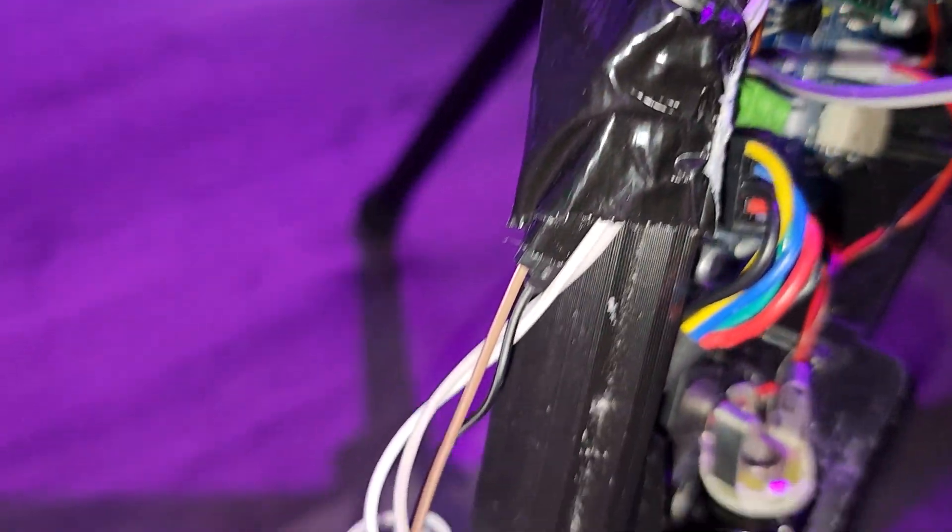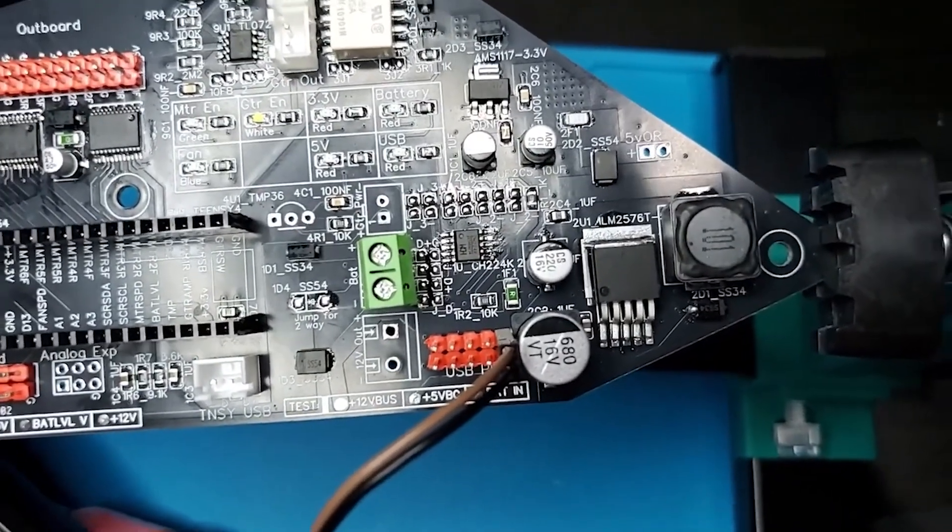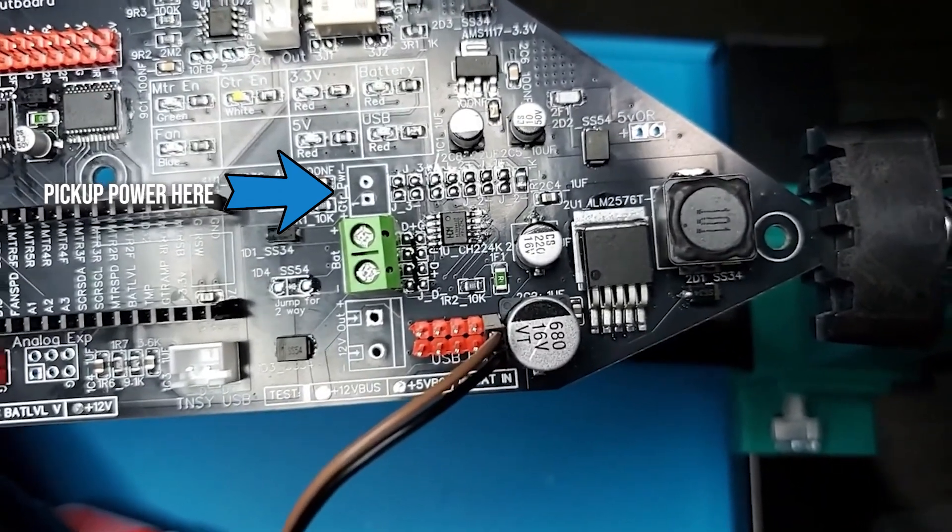I will say that it's still there and there is more testing to be done, but I think I kind of fixed it. I'm going to reserve my excitement until I get it all back into the guitar and see that same behavior again. But as of right now, the majority of the sound is gone. Going back to the EMI thing — when I run everything off of a separate little power section and move that around, I noticed that the volume of the remaining noise still changed a little bit depending on where it was. That tells me there is some level of EMI still affecting the noise. But what I also noticed is exactly what everybody told me was going to happen: if I'm powering the pickup off of the same circuit that runs all of this other stuff, I'm going to get interference in some way, shape or form. And plenty of companies have figured out how to eliminate noise leaking into pickups and microphones, so I figured why can't I figure that out too?